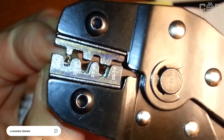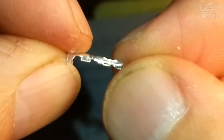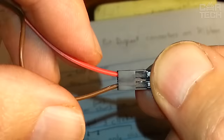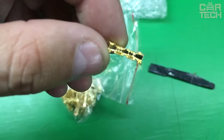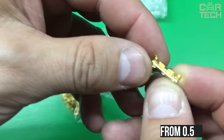Connecting clips for crimping wires: this method of wire splicing is more effective than conventional twisting, as the wire ends are fixed very firmly, reliably, and more easily than soldering, as it is only necessary to tightly crimp the clamp. The staples are made of brass with a tin-top coating. The crimping range of these staples is from 0.5 to 1.5 millimeters.